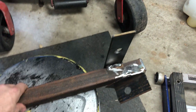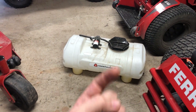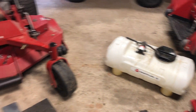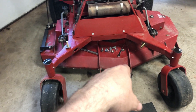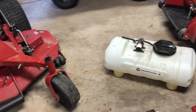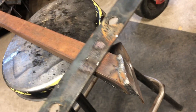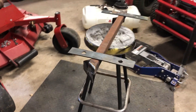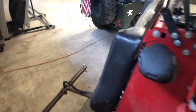It's just some two-inch angle iron welded to a one-and-a-half-inch square tubing, and this is some two-inch flat bar on top. Obviously the tank mounts right here — they have locations on the tank where bolts can go up in there and secure it. I just use these galvanized bolts, I think they're half-inch or three-eighths, basically finding the right bolt that fits in those threaded holes. I also capped off the ends right here just so water doesn't get inside the tube and rot it out. Over here I have my hose and my wiring, I got my switch right there, and I'm also going to take this apart and paint it.